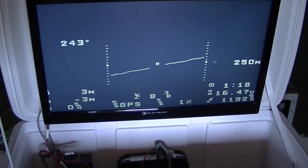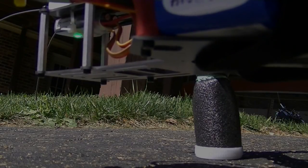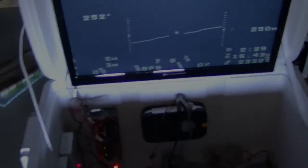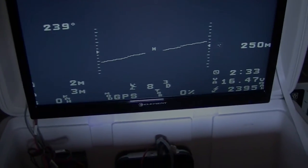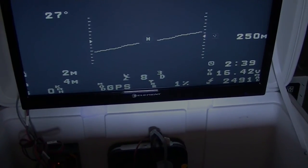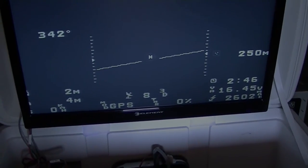Now let's switch over to 1280 again and see if the bandpass also works with that. Here's channel 9 for 1280 on my receiver. I'm switching the transmitter over to 1280, and the solid green light remained - it didn't go away and make red lights like it did when I didn't have the bandpass. Nine satellites - well, eight, but it levels the playing field between 1280 and 1258. Both frequencies get eight satellites with the bandpass and low-pass RF filters together.